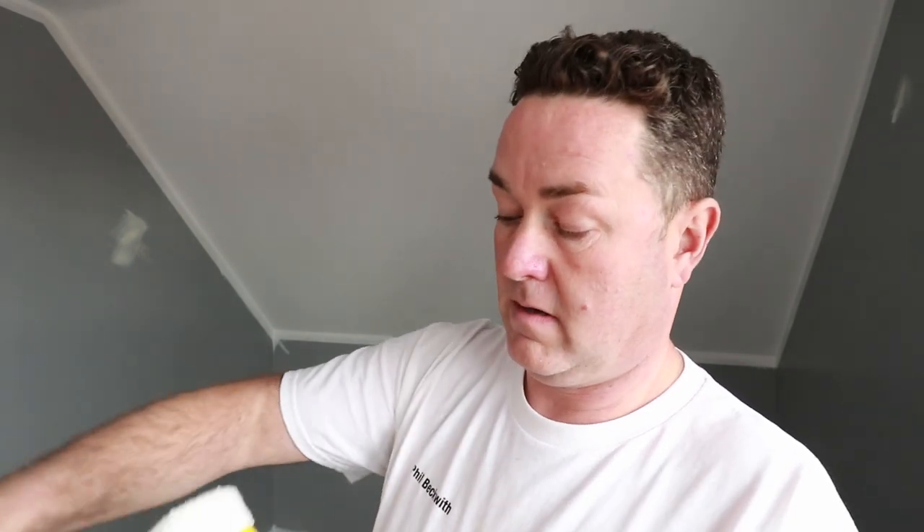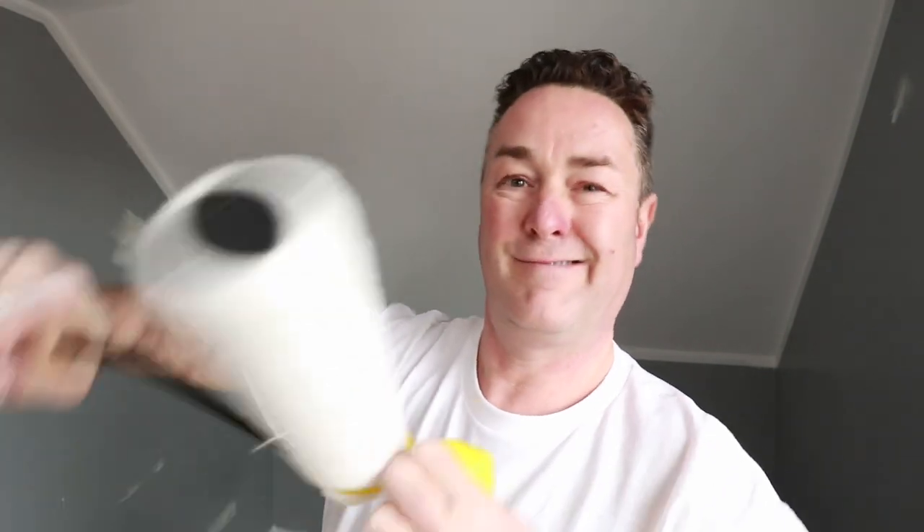I've also got the Two Fussy Blokes nine-inch roller frame - hand in glove, quite like that. A little bit of fluff came off with the tape - that's what you don't want going onto your paint, and that's why you put the tape around it. If you wash it out, what I don't like is unless you've got literally all the water out, when you roll the surface the pressure of your roller oozes a bit of moisture - I'd rather just either wash them out the day before or put some tape around.